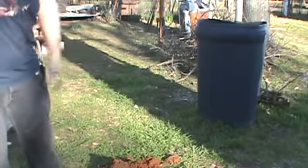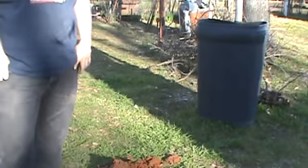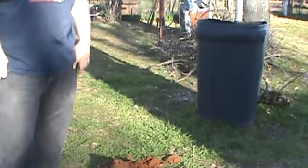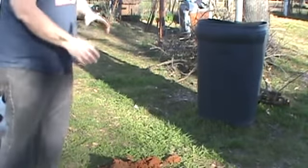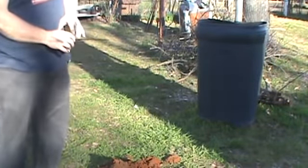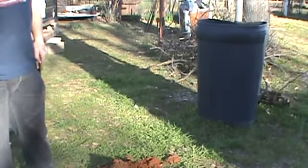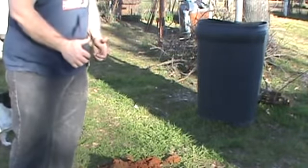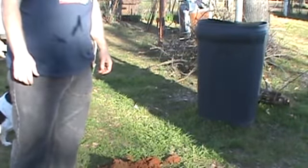You can go as far as you can with a 5-inch for the upper part here. And that's what I'll have to have a nipple for, or a T rather. A T that's in the 5-inch, and then you're going to have a slew box, either over here, it doesn't matter which side, but somewhere to run the water whenever the water goes in the 3-inch pipe down in there as you're drilling. The theory anyway is that it's supposed to push the dirt and the water and the sand back up to the top. We'll see if that's true. I'll give it a shot, see if it works for me.